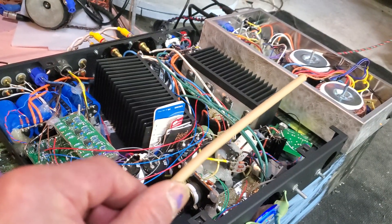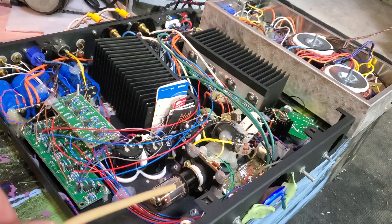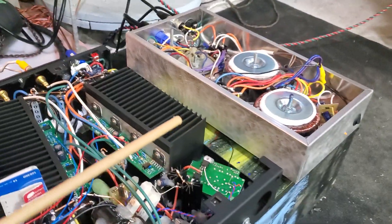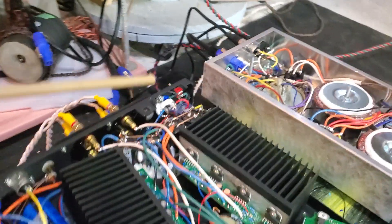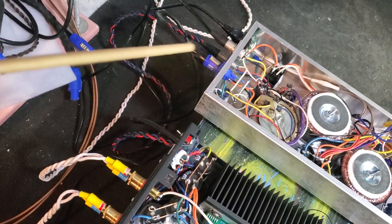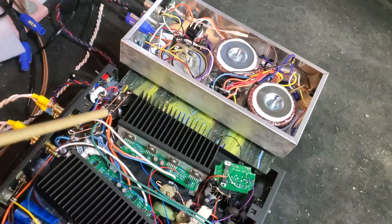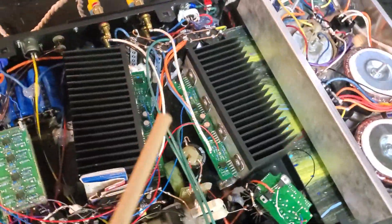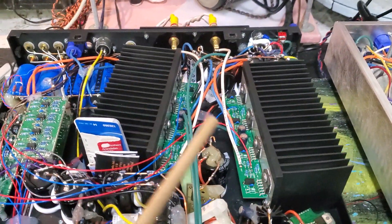I'm not talking about hissing, because hissing is mostly from the tube — it's the humming and the buzzing. In order to eliminate ground loops, there are three pieces of umbilical cord, a total of 10 wires from the power supply to the amp, and four of those are grounds. Now, talking about ground, we go to the second audiophile myth: the lowest impedance ground path.